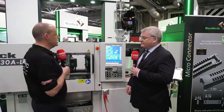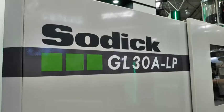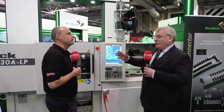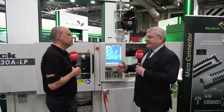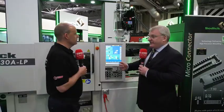The range here goes from the GL30 ALP upward. The 30 tons denotes the clamp force, and the other designation refers to the size of the injection unit — we have a 12-millimeter plunger and a 14-millimeter screw on this model. We go all the way up to 250 tons in this range, with up to a 50-millimeter plunger and 50-millimeter screw. In plastics, your first consideration is the physical size of the part for clamp force calculation, because ultimately the plastic is like hydraulic trying to blow the mold apart. Your second consideration is the shot size required. The benefit of decoupling the injection and metering process is that we can use a smaller metering section for very fast cycling, or a larger feed section, mixing and matching to optimize material residence time, heat-up periods, and injection speeds.